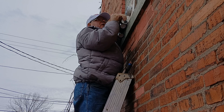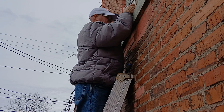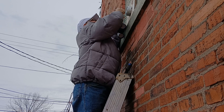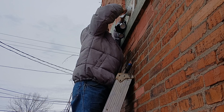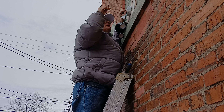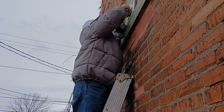Now I'm going to strip our ground wire. This wire is not tinned, so I'm going to strip it longer so I can wrap the strands around the solid wire and get a nice solid connection. I'll take our solid wire and wrap the strands around it like this. The insulation is going to go down into the bottom portion of the wire nut and our copper is even on the end. We'll twist it down on here and get it back out of our way.